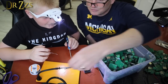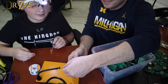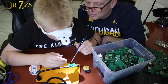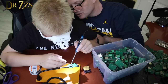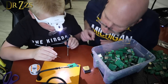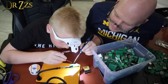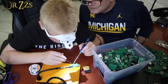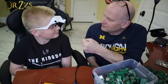I want to get shiny. You're going to need just a little more on that. Sometimes all you have to do is just re-float it — you don't even add any more solder, you just melt the solder again for another couple of seconds. What if they actually touch each other? That would be a short, and that's no good. I'm going to try doing the re-float. Good — perfect. Good job. Dawson, not bad for your first day soldering. Good work, dude.